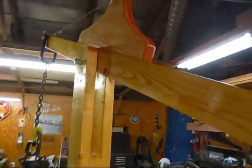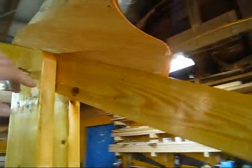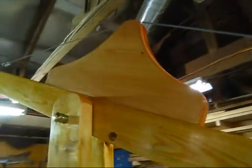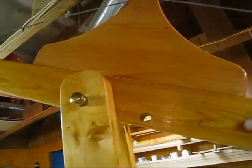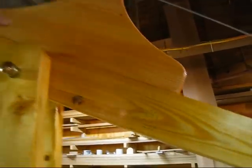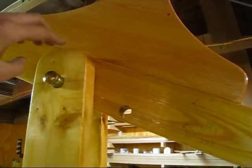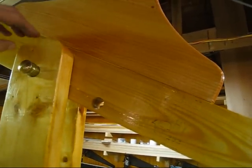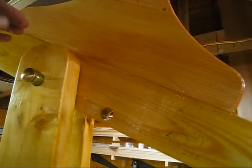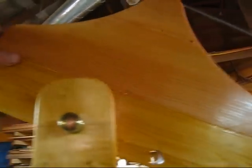The fix I did actually works in two ways. The first: I took a piece of fir and cut it out into this shape and epoxied it right to the top of the 2x4 right over the two lifting holes. That will probably be enough alone to strengthen this 2x4, because when it's under load, the top of the 2x4 is in tension — the fibers are wanting to pull apart, and that's how it would break, right at the top. By adding all this material on top, you're going to resist that and it's going to be a lot stronger.